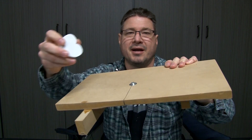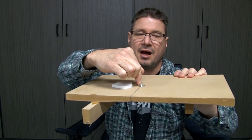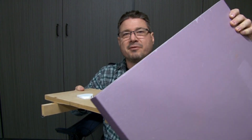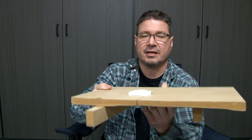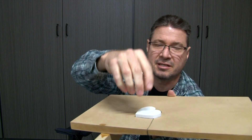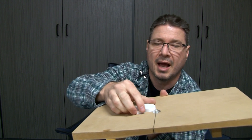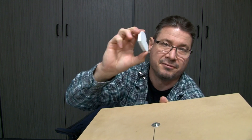I printed off a 3D pattern and the hot wire would come straight off the top. I could stick the styrofoam - here's the styrofoam that I picked up from a hardware store - I could stick a little piece of the hard styrofoam on the heart and then run it around the hot wire, then pull it off and I'd have an exact copy of this pattern.